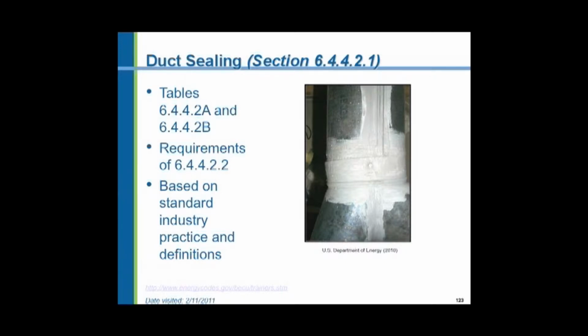But the university has a warranty period on all their new buildings. The contractor's to come back at the end of 1 year and fix anything that's gone wrong. When he came back, all that tape was lying on the floor. It didn't even last 1 year. So a tape that you would think would be an expensive aluminum foil commercial tape might not even be suitable. My preference is for the mastic brush-on duct sealer. It may not look very pretty, but it works very well.